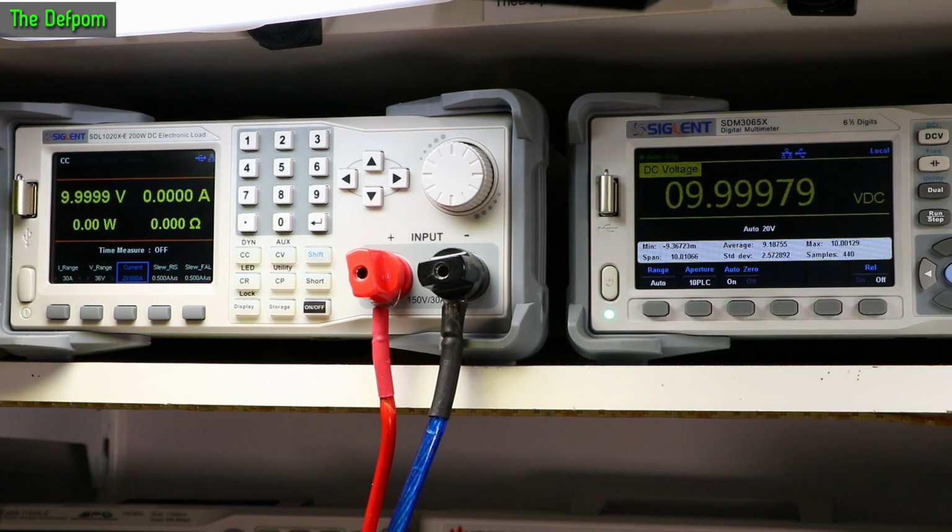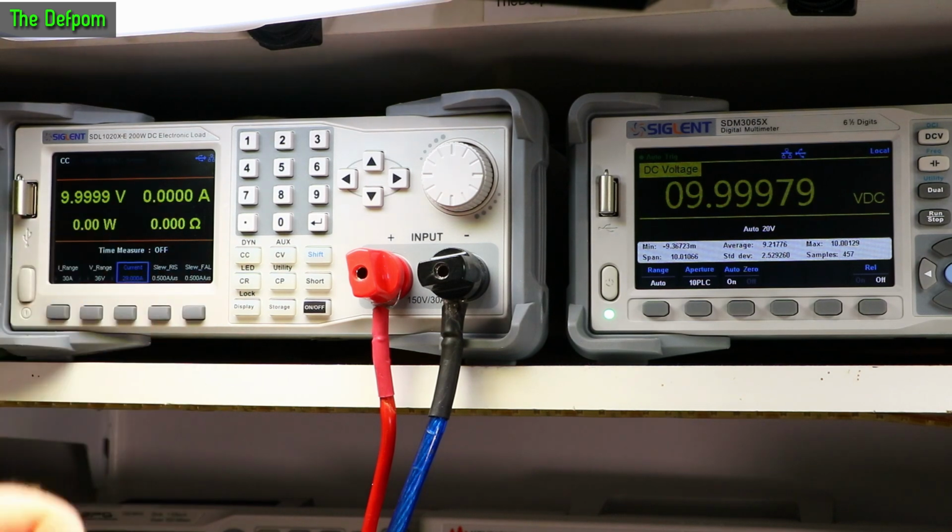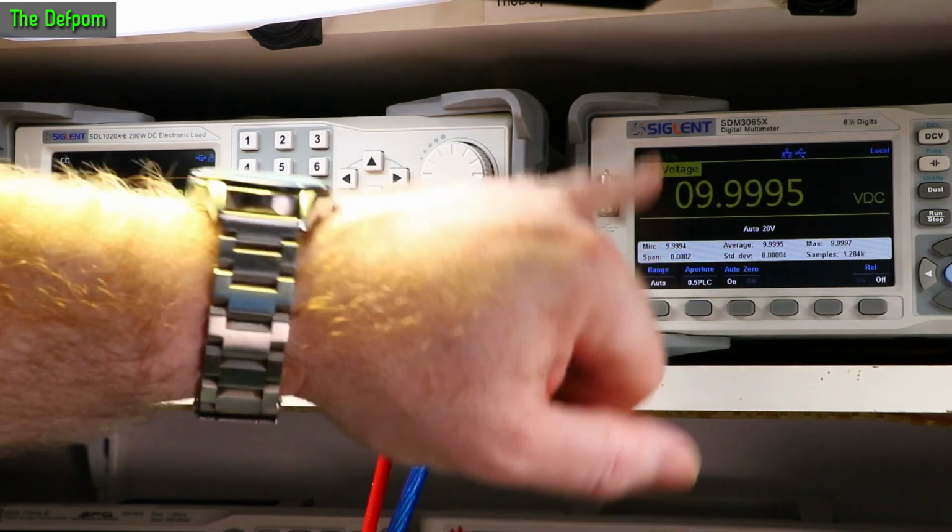As you would get, it's a bit like a switch mode power supply, as in like a buck converter or boost converter, how they're switching on and off to create more voltage. It'll probably be the same thing. When a load shuts off, you probably get a spike. That's not too surprising. So I'll just change my multimeter settings here to make it a little bit faster.